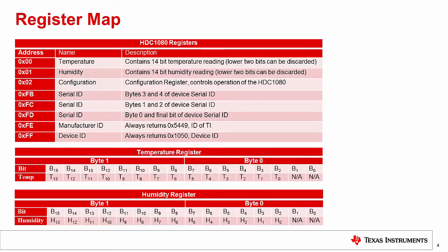The first of the three main registers is the temperature register. The table beneath this register map shows how both bytes — all 16 bits of this register — are organized. Bits 15 through 2 are the actual temperature reading, and the lower two bits are unused and will always read zero. The table beneath that describes the humidity register, which by default is organized in the exact same way, with the upper 14 bits representing the humidity reading of the device. The resolution of both readings is adjustable by using the configuration register, which we will discuss momentarily.